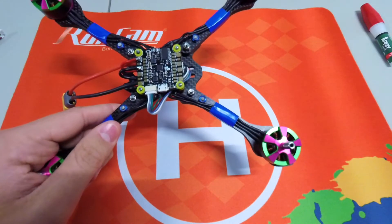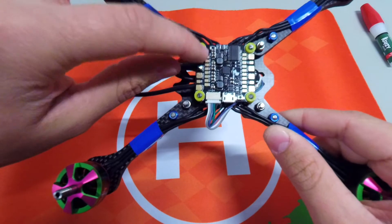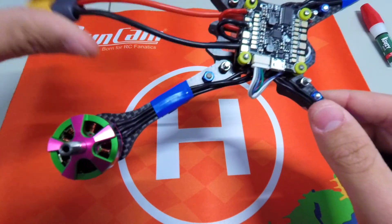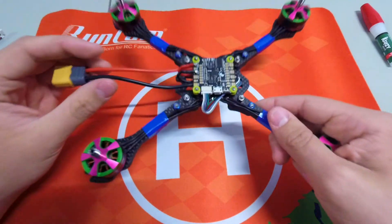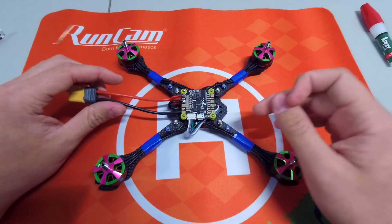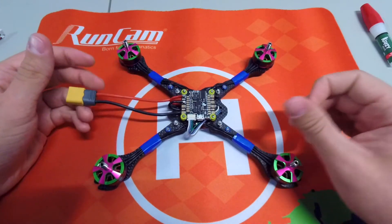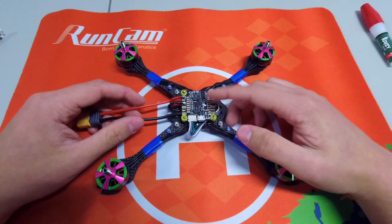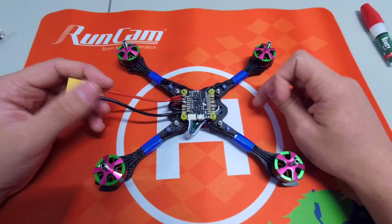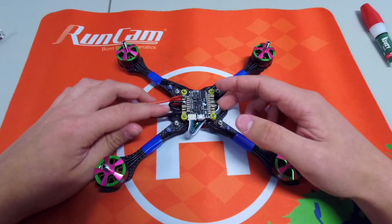And that's really all you need to do — super simple and super clean. I used 20 gauge wire for my ESC pads from the flight controller down to the ESC, and 16 gauge wire for my XT60 cable. I set it up this way because I want current sensing when I race and fly. You don't get current sensing if you power your ESC first and then go to the flight controller. I contacted CL Racing and posted in some FPV groups, and they said the best way is to power your flight controller off the battery and then power your ESC off the flight controller.